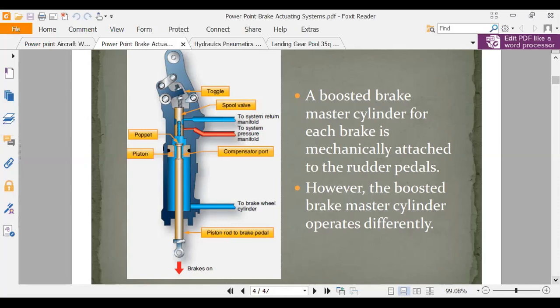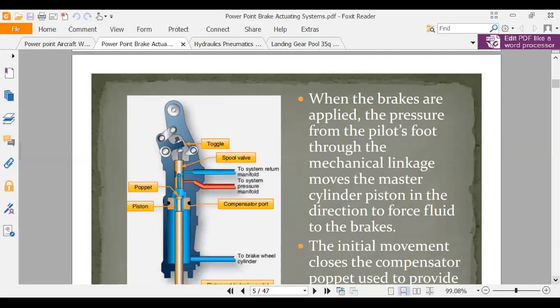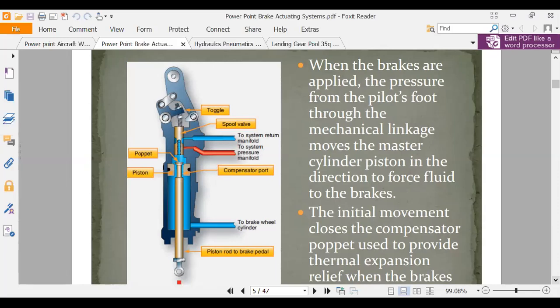Well, your car has a brake booster. When you push on the brakes, if you lift up the hood, you've got the brake master cylinder, and then right behind it, there's this big drum. That's the brake booster. So I guess that's true. When you push on the brake, you're running the booster. You're not actually running the master cylinder, I guess. Anyway, the way boosters work is that you have a difference in area size.